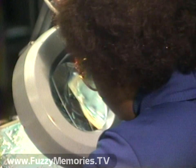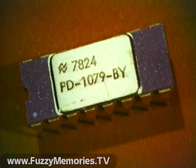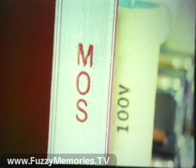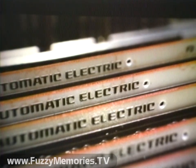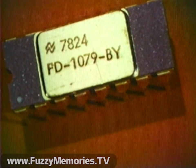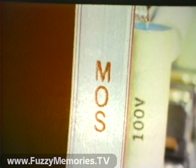It's not difficult to spot a static-sensitive device — it's simply a matter of knowing what to look for. Component number FD-1079 is an immediate signal that you're working with a MOS device. Of course, the letters MOS signal static sensitivity too. But the most common signal you can look for is the color red. Red indicates that the individual component or PWC you're working on is static sensitive and precautions must be taken. You can identify the MOS device by the component number FD-1079, the letters MOS, or by the color red on the printed wiring card assembly or the component itself.